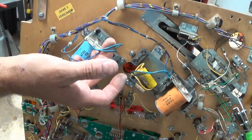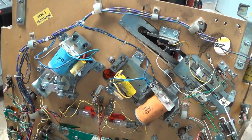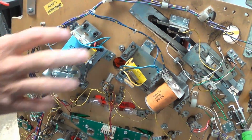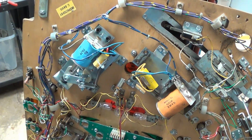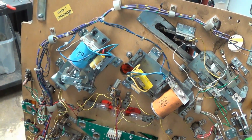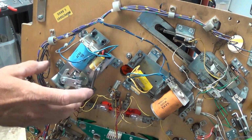Sometimes you'll see these have been replaced so many times people will throw the original wiring away because it's too short, and they'll put this in. You should keep it the same vinyl diameter to be consistent with it, but this is the correct way to do a flipper rebuild from beginning to end. It's sort of an advanced repair or maintenance issue in machines because of the mechanical and electronic finesse you need to do it.